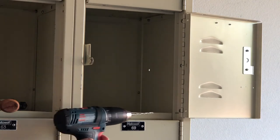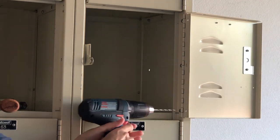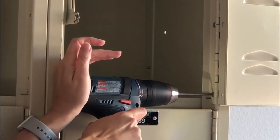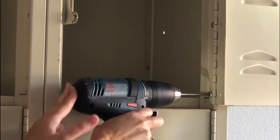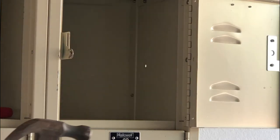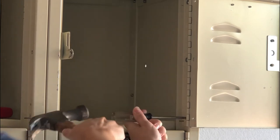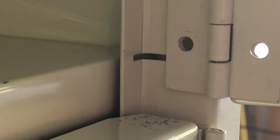I have three rivets right here. I'm just going to drill right into the same hole. I have to move it around a little bit to drill it out, and you have to push really hard. There we go — it comes right off. Now there's still the other piece of the rivet inside, so I'm just going to use this hammer to punch it out. I just heard it fall all the way through. That's what it looks like after I've popped the rivet out. No damage at all.